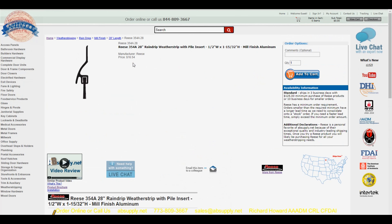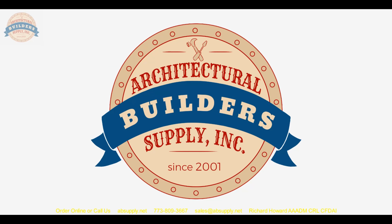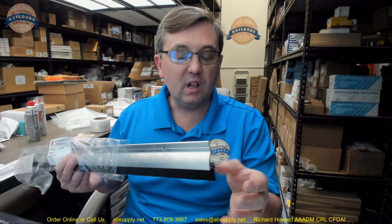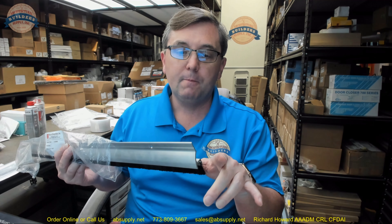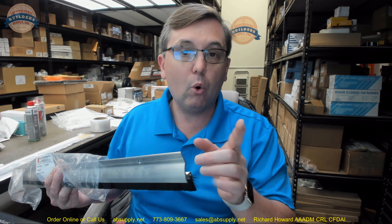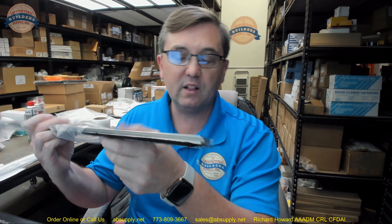This threshold is listed on the website in several lengths. This particular piece happens to be 28 inches — the client has a very narrow door. If you need a custom length, whatever your application is, order the next longest piece and indicate in the comment field the net length you would like us to cut the material back to, and we will be happy to do so. You probably don't need a 36-inch piece; it would be better at something like 35-13/16. By all means order the next longest and specify the net length.